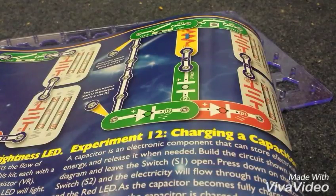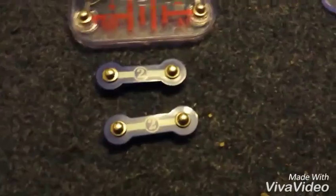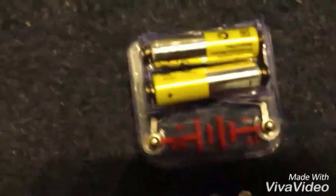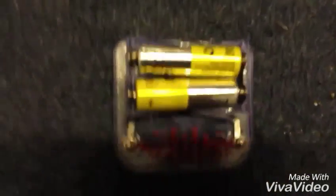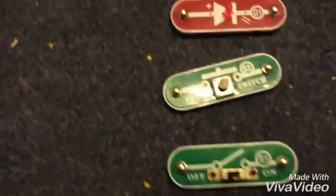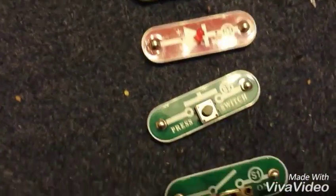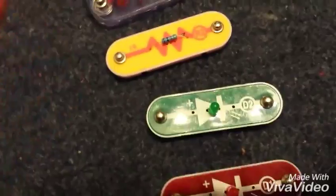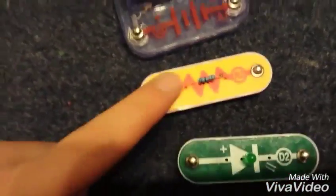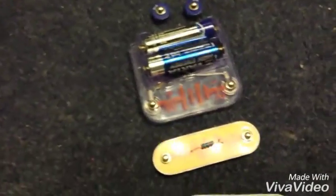Let's get into the making. You will need a six clip, two two-clips, a battery pack, a switch, a button, D1 red light, D2 green light, and R2 — that's 1k ohms, so a thousand ohms. You will need two battery packs.